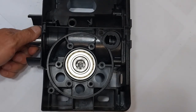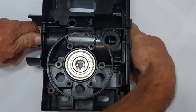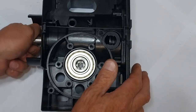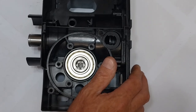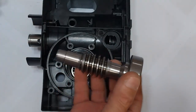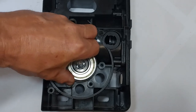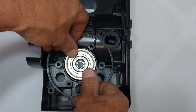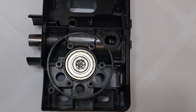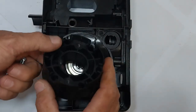If you want to take it out, make sure the gate motor is in gear, and remove it by turning the main drive shaft — that's how easy it is. The worm gear is kept in place by this plastic coupling.